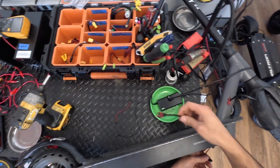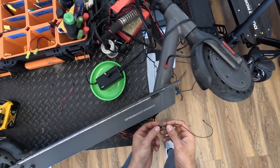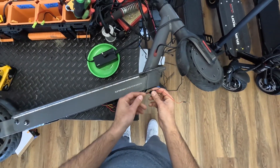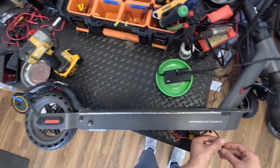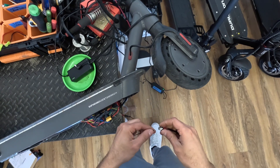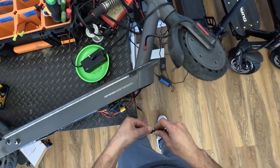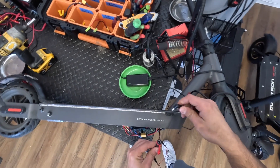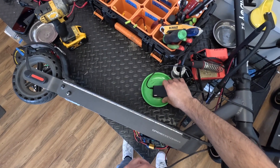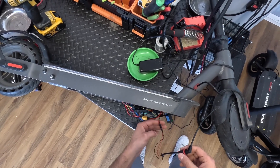We need a way to charge the battery directly through this JST connector to see what will happen. I've got a basic wire with male ends on both ends — red to red, black to black — along with a basic charge port connector, also wired red to red, black to black. So if I plug in the same charger I was using before directly into this connector, you'll notice it goes red.